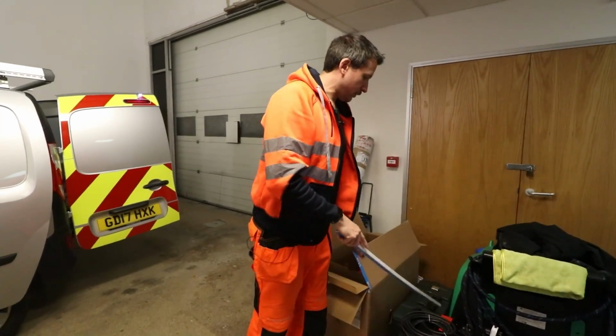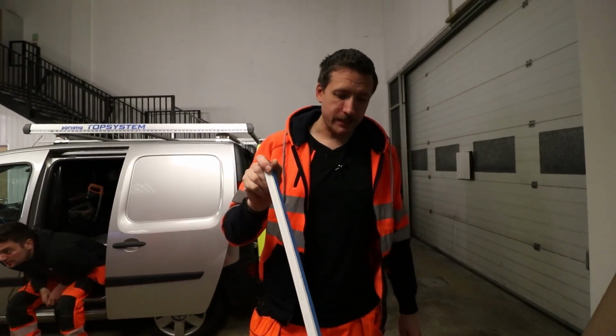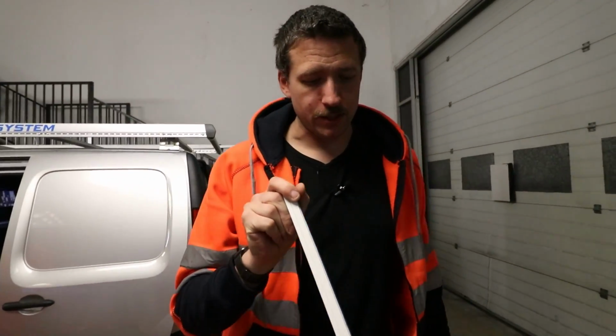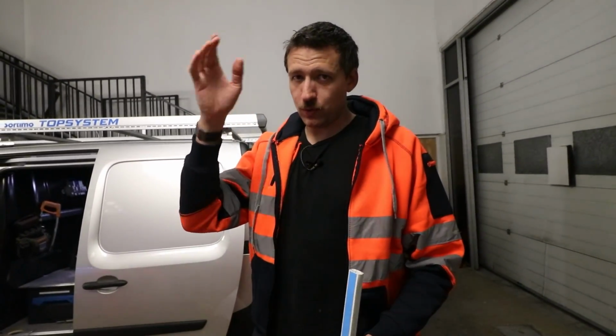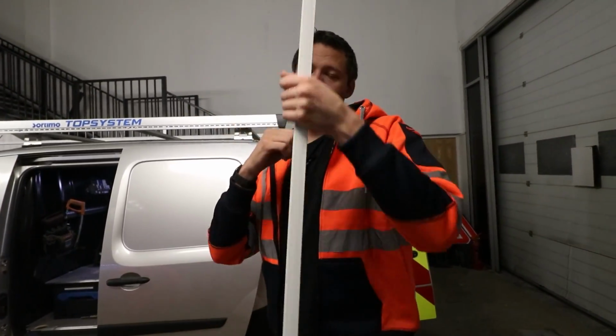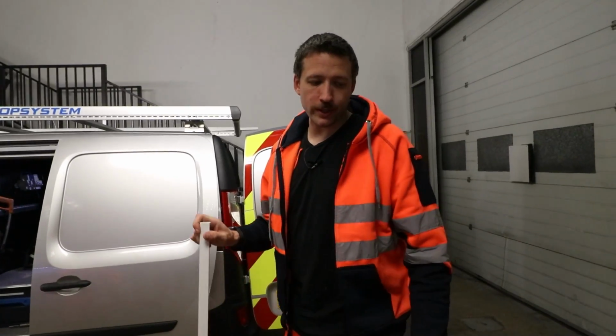And the wall chaser, we've got a house rewire which we're starting on Monday, so that is going to be in next Monday's content. I'm looking forward to that because that house has so much chasing to do, and it's got the triple disc. Apparently, rumor has it, you don't have to use a breaker to chisel the wall out afterwards. As you run up the wall, it just leaves you a nice hollow chase to put an oval pipe in and put your conduit in and stuff. So yeah, that's going to be coming out on Monday.